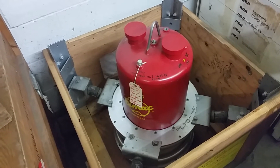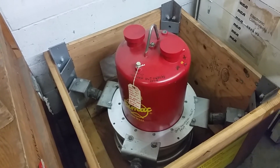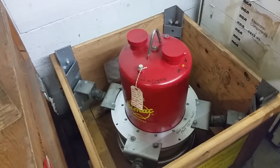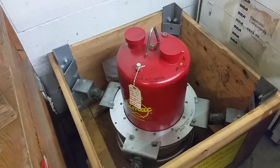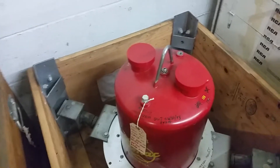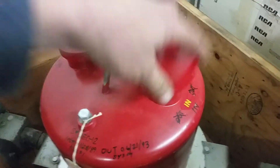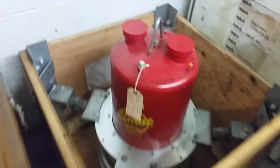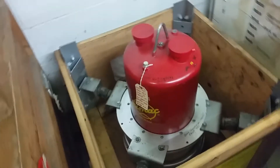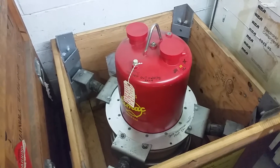Looking at the specs: the filament — I believe it's a three-phase filament — 16.3 volts at 640 amps. That's a lot. You can run these things up to about 30 MHz. Plate voltage is 20 kilovolts and you're talking nearly 100 amps at that point. The red caps are once again for the cooling water. These were apparently operating spares on the reactor, and you need to push 300 gallons a minute through this thing.